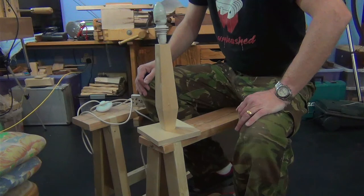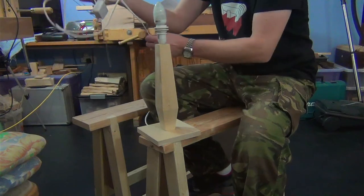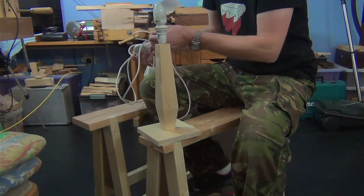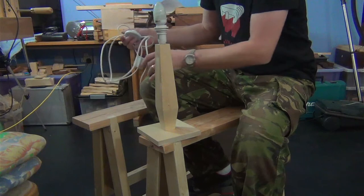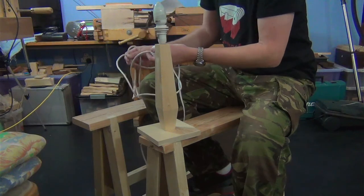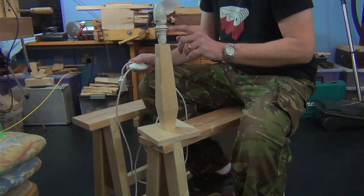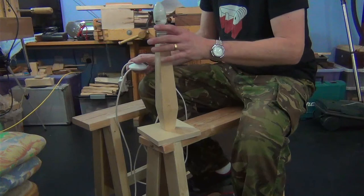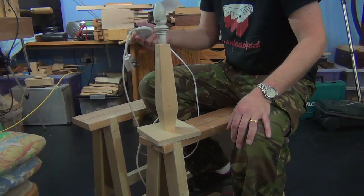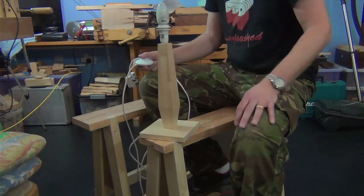Did you replace the wire with the three-core? I now have nice safe wire. Because this lamp holder is all plastic, I only need two-core to that one. Ah, that's fine then. But I've got three-core to the foot switch for it, and that's all cabled up as well. I knew this one was safe because it's come off something else which I was throwing out, and that actually did have a metal support for its shade. So I'm not quite sure how that worked, but I knew the rest of it was safe. So do check out your regulations if you're doing this yourself.